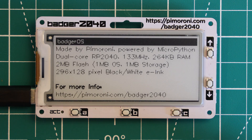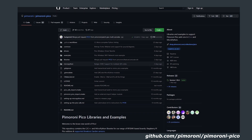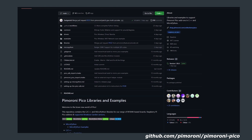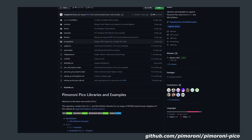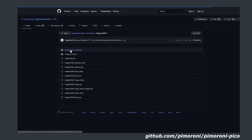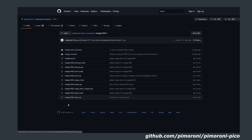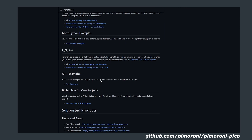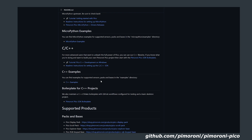In terms of programming this board, Pimoroni has released both MicroPython and C/C++ libraries. Personally I use C, so I'll be programming using Pimoroni's C libraries, which are all explained with examples on their GitHub — I'll leave a link to that repo in the description. If you are interested in a tutorial about how to set up and use these libraries within the VS Code environment for the RP2040, let us know in the comments. After writing your code, you upload to the Badger 2040 just like the Raspberry Pi Pico: hold the boot button as you plug in the USB-C connector, then drag and drop the UF2 file and it will reboot and run your program.